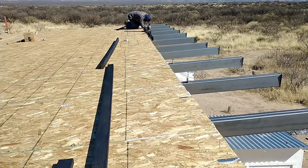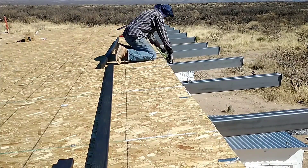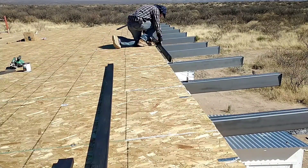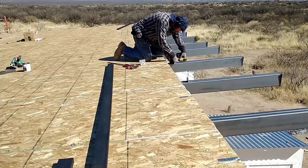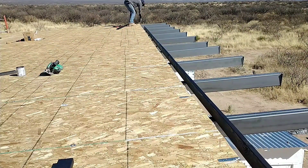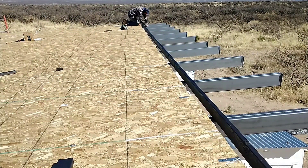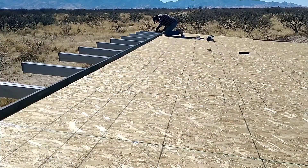Moving on to the south side overhang, I had to put on three runs of board. The first one is a 2x4 run, similar to what I just finished on the north side. I'm working on the north side, which only has a one-foot overhang, similar to the sides — three sides have a one-foot overhang, and the south-facing side has the four-foot overhang. Also worth noting: these 2x4 runs are positioned 2 inches away from the wall, so there'll be room behind them for the foam to come up and complete the thermal envelope all the way around the house.